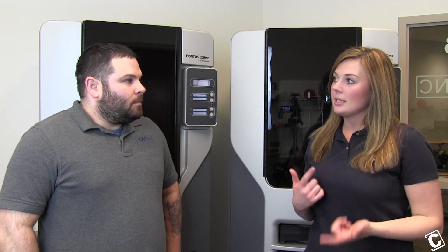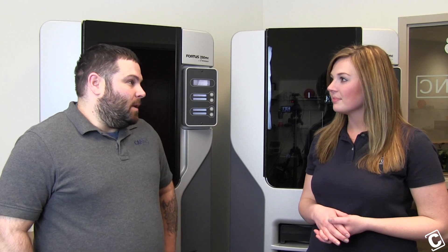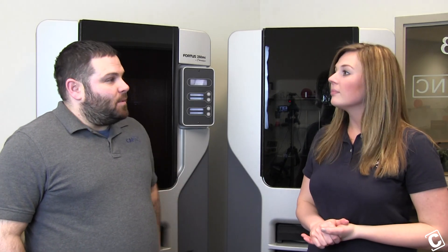When we are replacing these tips, do we need to replace both or one at a time? We need to replace both tips at the same time and they need to be calibrated. Why do we need to calibrate them after we've replaced them? We need to calibrate the tips because they've moved position when you've replaced them. Do you need to reset the tip time? No, it's all part of the tip replacement process.